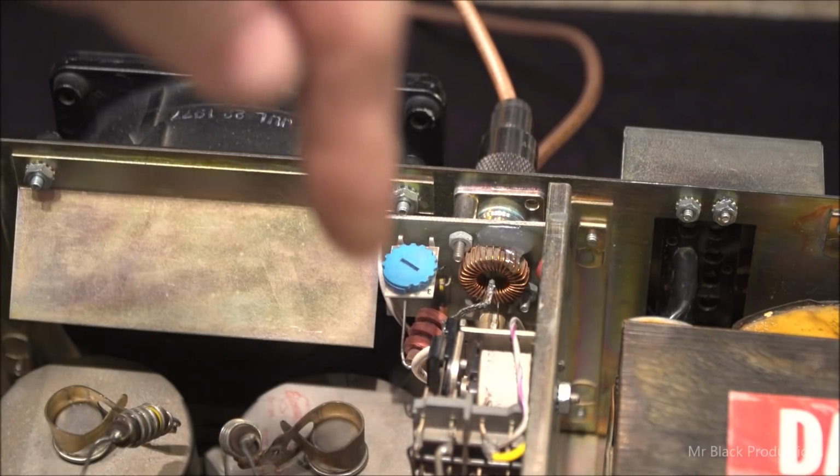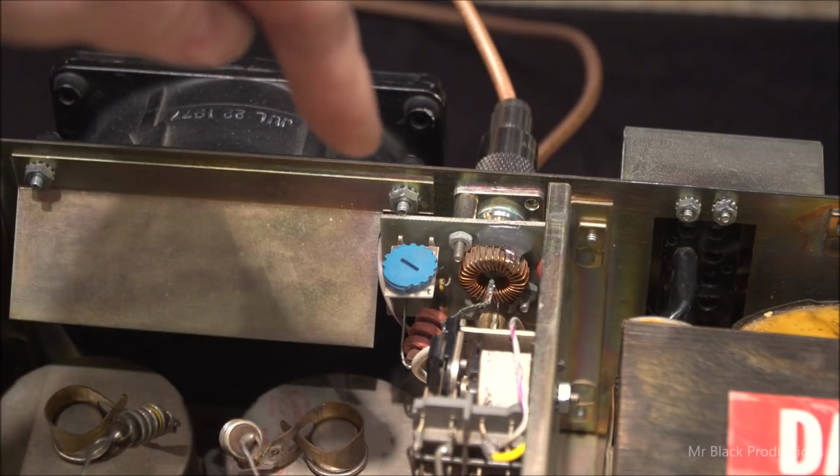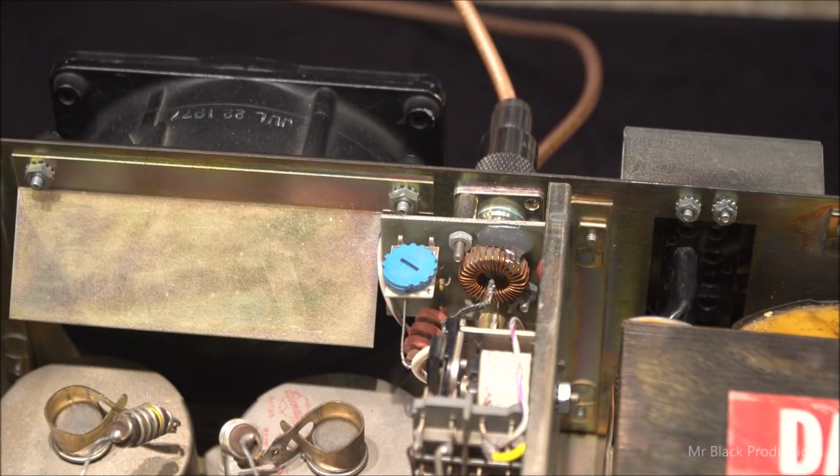This whole corner back here, both the coax connectors were slopped out, okay? They were pretty rough. Actually, the output coax connector was cracked and broken and was shorting. So I went ahead and I replaced that with good Teflon, silver-plated coax connectors, redid the wires, and rebuilt the power bridge because it was a mess.